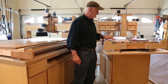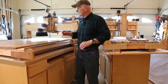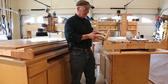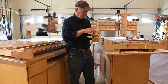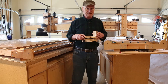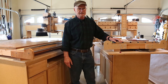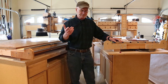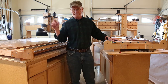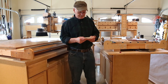Some other differences: the width of the Z-box on the shoestring CNC is about four inches, and on the Gatton CNC it's five inches. There's probably a reason for that — on the router mounts, the screws on the shoestring were one inch apart, while the screw width on the Gatton CNC is two and a half inches apart. I think that adds more stability and also gives you the flexibility to get third-party router mounts, which is what I did on my Gatton. That bolt spacing is more standard for different types of router mounts.